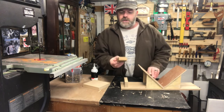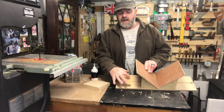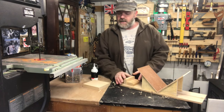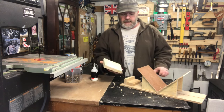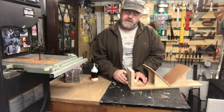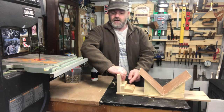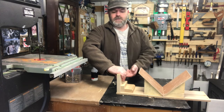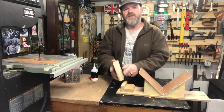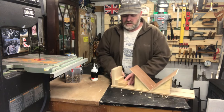And what I thought I'd do is stick a hardwood block on this side, just so that if I hit it, I'd see the blade hit it and it would take a while cutting through. But even better than that, I'm going to glue and screw this piece of maple onto there to make a higher handle, so that even if I cut all the way through, the blade won't touch my hand, it would go straight under. So for a start, let's just take the corners off there, make it look a bit better. And then we'll just attach it on there.